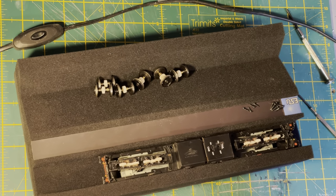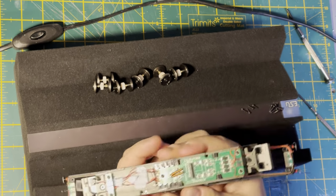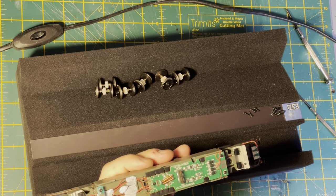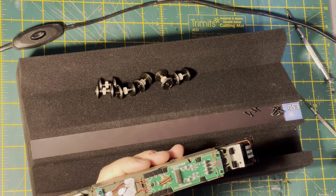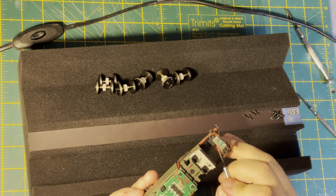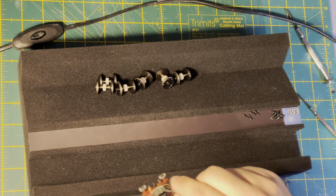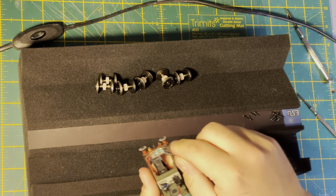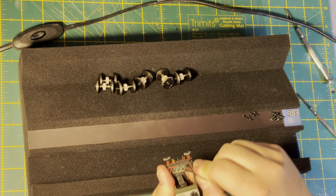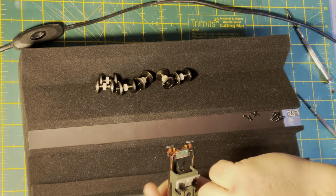Just whip those out. Now before you take this off the bottom, you need to flip the chassis over, and you'll see you've got these little PCBs here. That's where the contacts go for the lights. So we'll just get a little flat blade screwdriver. We'll pop that under and try and pop them off. So I'll start with this one. Just want to pop them out. They've got little pins that they can locate on. There we go, there's one. And then same again on the other end.